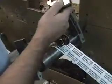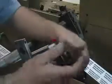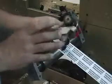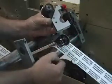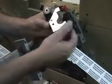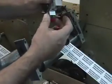This part back here, I'm glad you asked, because that's our coarsest adjustment, to position this roughly. Our secondary adjustment is going to be to position this, and our final adjustment will be the spring tension. The spring tension should never be used to bring it to proximity. It's only for tension. What is actually bringing it into proximity to the roller, touching it or away from it, is this right here. So you're going to want to pay careful attention to what happens to this mechanism in the setting up process, because what we're going to do is back this out to the touches, right?